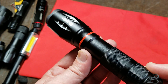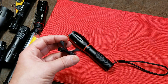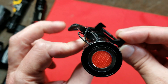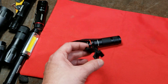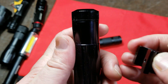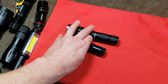About the 'tactical' claim: if you're going to use the name 'tactical' and put those diameter markings on a flashlight, those diameters ought to follow some type of standard. There's a series of ring-size standards for mounting a flashlight in a tactical way — one of the most common is one inch. This flashlight measures 1.025 inches, which is not an even size in metric or fractional. We can see it does not seat down properly in a one-inch mount — you can see light under it — meaning it's going to crush that barrel. It's not meant to be mounted in any form whatsoever. Things that really are supposed to be mounted, like this Maglite XL 150, are one inch, and when you put them on these adapters they fit nice and snug. Furthermore, the knurling on the battery cap and around the front has been rolled flat so that even where it's knurled it is also one inch.